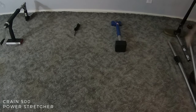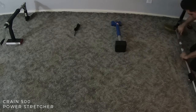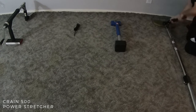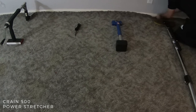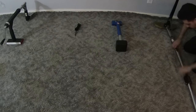Let's start with the power stretcher head using poles. This is definitely without a doubt the best tool to use for stretching carpet. I bought mine brand new for about $500, but they're going for about $700 now. Once the stretcher is set up, it is almost effortless to use to stretch the carpet as tight as it can get. Now I'm just locking the carpet onto the tack strip to hold the stretch, and I'll do that for the other areas too before cutting.